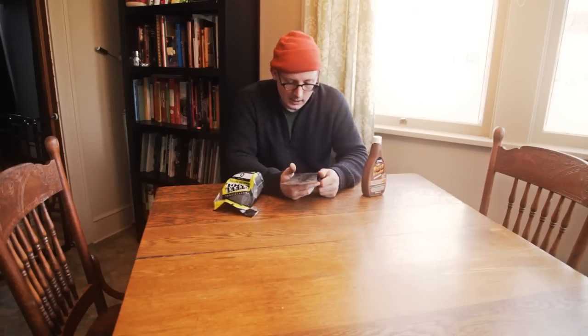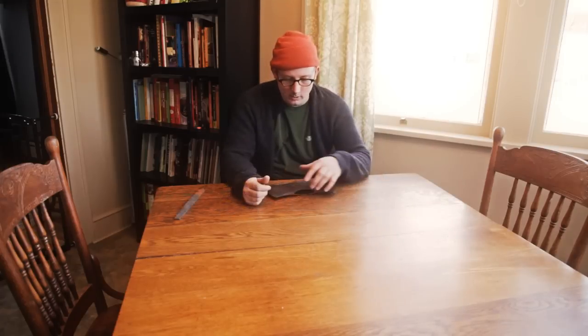The next thing the book says is that if you're going to re-handle an axe, take some time and bring it back to perfection in terms of the edge and everything else. The first thing I'm going to do is remove some of this rust — I do it the lazy way with a little rust remover and some steel wool. You wouldn't necessarily have to remove the rust, but since I'm going to the trouble I'm going to bring it back to factory specs. Now that the rust is cleaned off, the next step is to find a little burr on the inside. If you try to put an axe handle in with that burr there, it will catch and peel back some material. There's also one on the top — I think my grandpa took a hammer to it when it slipped — so I'm going to take that off.